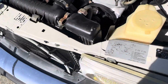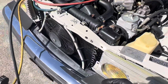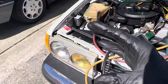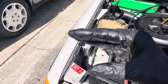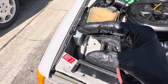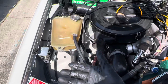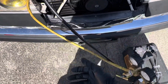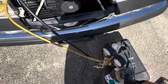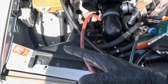But he said he flushed it out and he had great flow and everything like that, but that could fool you, because sometimes you could have flow and the valve doesn't flap down and close and it stays open, and the flow that you're pushing through there is not enough to make the valve collapse. Your shop air is what, only 150, 175 psi. Well, I could blow 600 psi through there if I want at a really high velocity, and I can make it collapse. All right, let's see what we get.